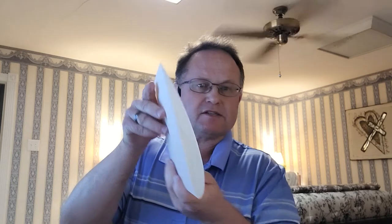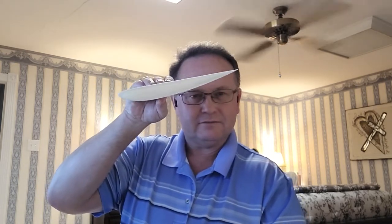One ultralight autogyro rotor blade tip segment. I didn't get to explain much about how I was setting this up to do it in segments, but basically you can kind of see a socket right in there. There's an inner segment that will stick in here 100 millimeters and come out 100 millimeters, and there'll be an exterior segment that'll slide over that. All this will be glued together — each segment will extend the length until we get the length we're wanting, which presently I'm thinking about 16 intermediate segments of each interior and exterior, which would put the overall length at around 3,600 millimeters, or 3.6 meters — it's almost 12 feet.